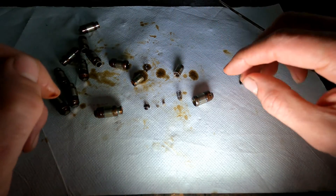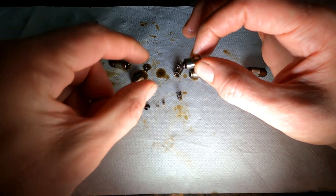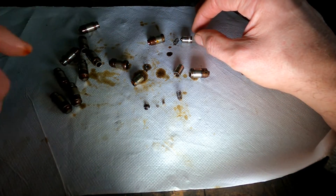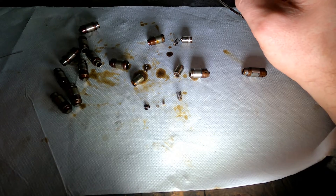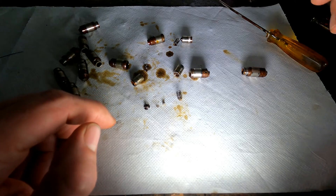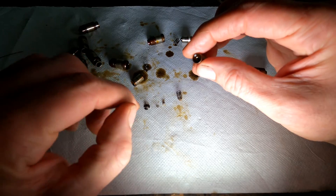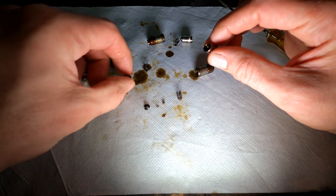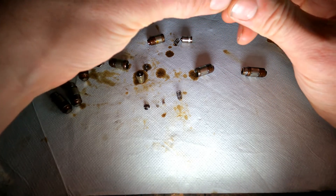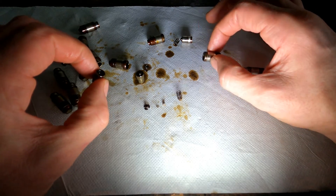What I am doing: I only remove it like this, pull it out. There is a spring and you remove the spring — and this is what I do. I clean this and that is it. You can dismantle it a little bit more; I did it with this one. Normally there is a very small check valve in it but I am not going to dismantle it because you can test if it works or not. I only clean it with a degreaser, get all the old oil out of it, put a new drop of oil in it and that is it.